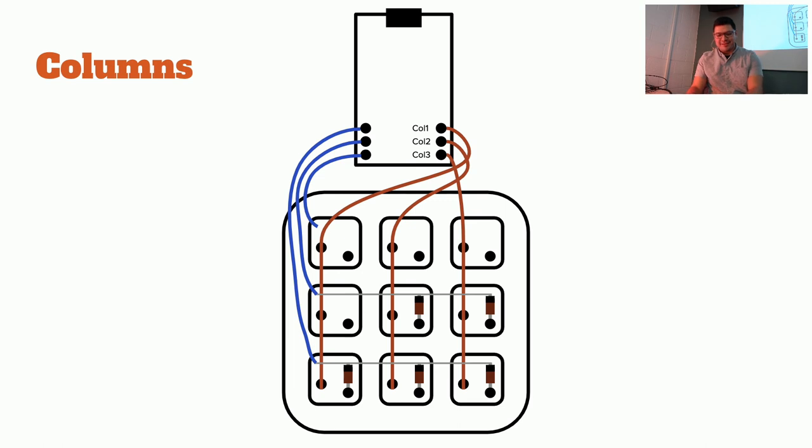Well, I'm going to make another one of these at home tomorrow. Oh yeah? And with your Omron switches? They're not working. There are three poles, and I don't understand why, because the two outside poles are combined, but I don't get continuity when I depress the key. It's really weird. I have to show you the switch. That is really weird. How would that work?